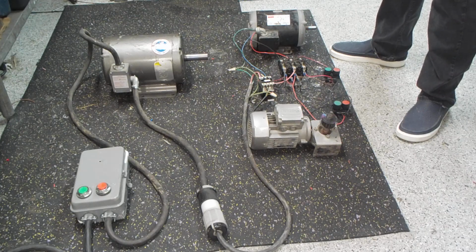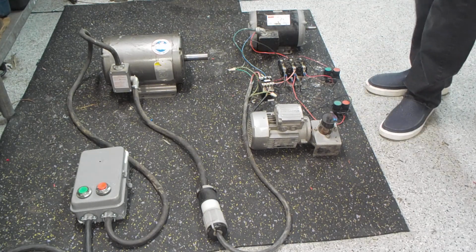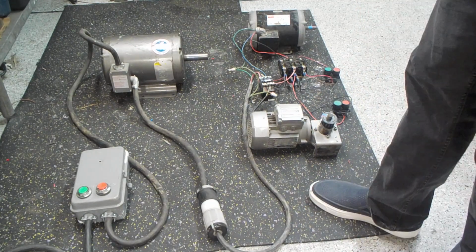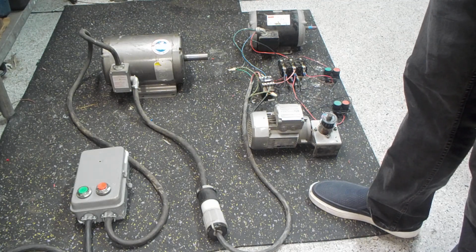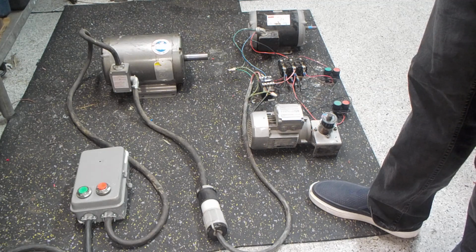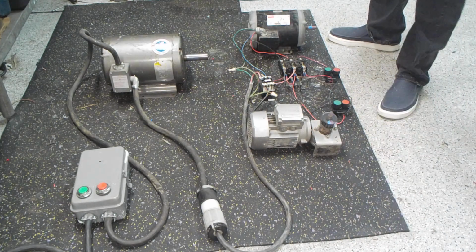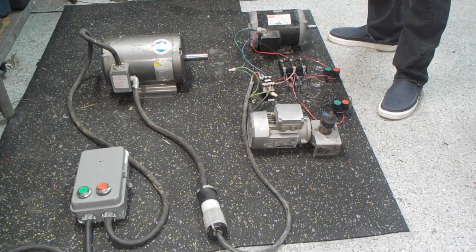If this video raises more questions than answers, I'm more than happy to elaborate. But for right now, this is the demonstration of how this rotary phase converter works by trying to start different 3-phase motors. And as you can see, I can do them independently, and these motors don't act like they really notice a difference. Obviously, there's going to be a slight phase lag from the RPC, but these are not sensitive pieces of equipment, and for their intent and purpose, as they're running, they help with the three-phase field.